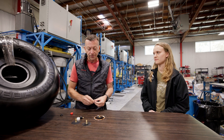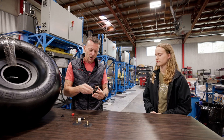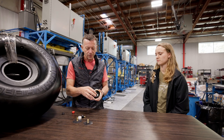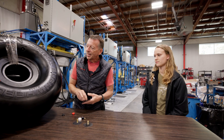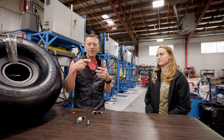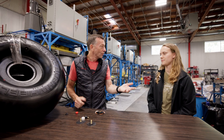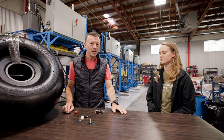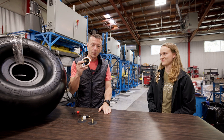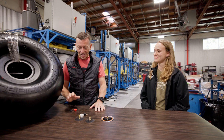The reason this thing would get weak or falter over time was: first, it didn't have a very good thread purchase with the old technology; and second, if you're running a low PSI tire and it spins on the wheel, you get aggravated friction between the wheel and the core of the tire, and over time that loosens things up. So people would get these invisible leaks and not know how to fix them. We've got a solution for it, and your next set of tires is going to have it.